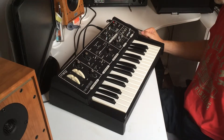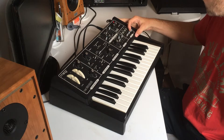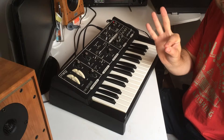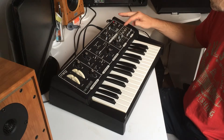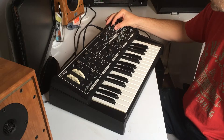It sounds very nice, but you may not want it stuck in its own position. When I switch all the way back down again it doesn't play anymore, but there is a residual noise going on. Basically it seems like this pot either needs replacing or cleaning. It is low when you compare it to the signal-to-noise ratio this synth can produce.